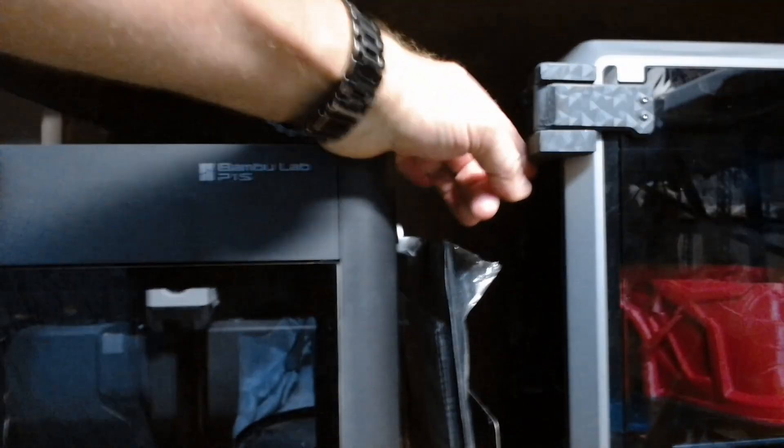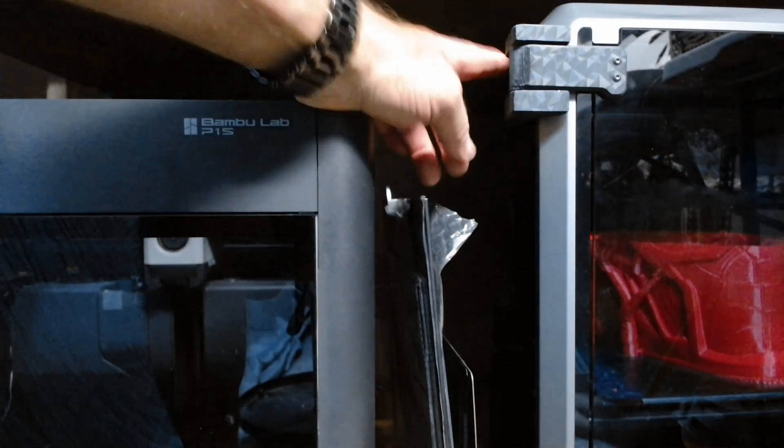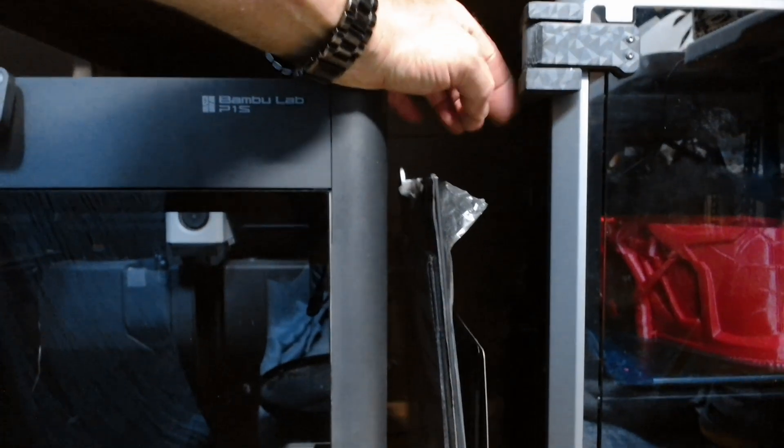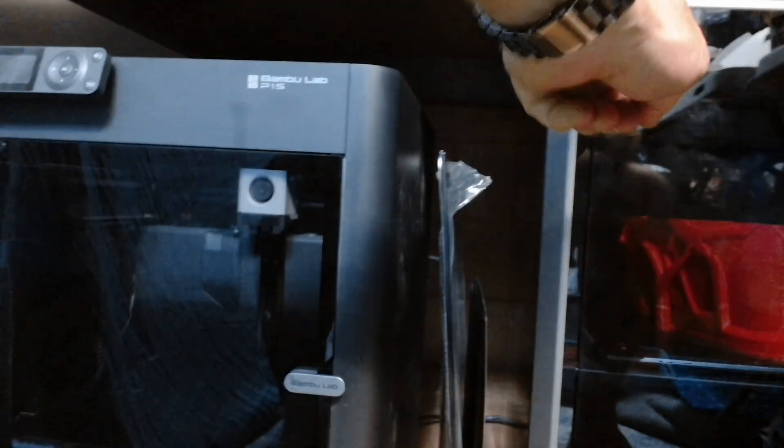If you don't want a Jesse incident, I suggest you put these on. It is really easy to do — there are two screws at the side, and the screw holes are just taking out screws that are already there holding your side panel on. So you just need to take them out and screw that bit on, do the same down the bottom here. This is a print-in-place hinge, so you don't need to do any connection — there are just two screws there, two screws here, and two screws down the bottom here, and that's all you need to do and then you've got it working.